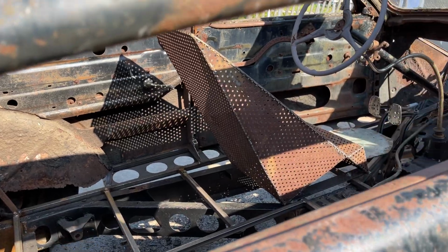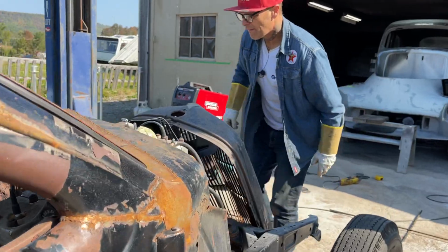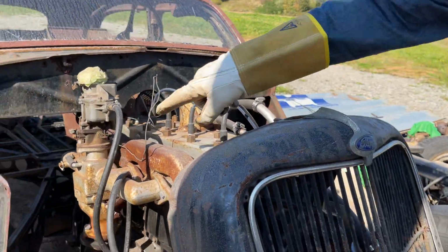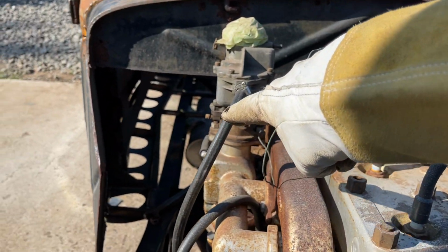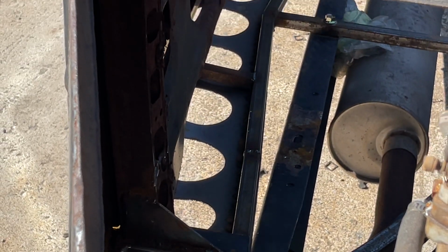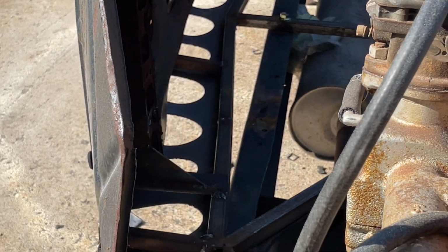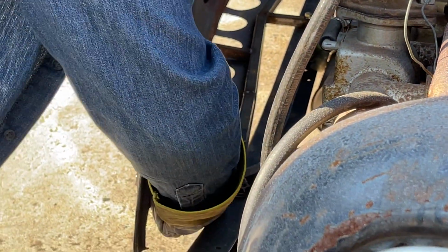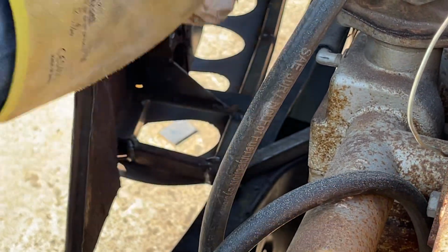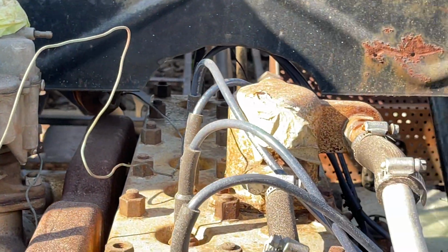We've got square tubing up the front. If you come up here, you can see the A pillar where I've got that on. Got it gusseted. Then there's a piece of square tubing that runs from the outside square tubing to the skeleton, and then what we'll do is cut this metal off here, then we just hammer it up and weld that nice and tight all the way across there. Closes that sill in, makes it tight. We'll do the exact same thing down where the wheel well is.